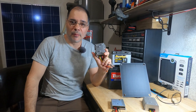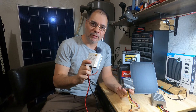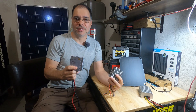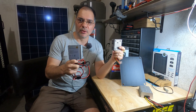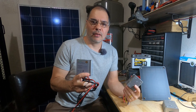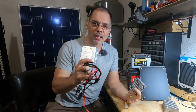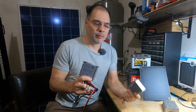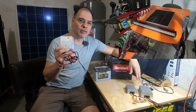A buck converter can be used as an emergency battery charger but should not be a replacement for a proper battery charger. An MPPT charge controller will monitor the battery's voltage and adjust its output as required, whereas a buck converter will not — and the charge controller is at least two times more efficient at charging batteries. A buck converter with 12 volt output will not completely charge a battery, and it's not a good idea to repeatedly cycle a battery partially. The charge controller requires a battery hooked up to work while the buck converter does not, and the load port on the charge controller doesn't have the same surge capacity as a buck converter for starting small motors. For this video, the MPPT charge controller was the clear winner and will be installed on the off-road vehicle in a future video. Thanks for watching.